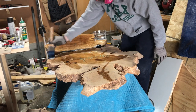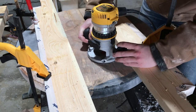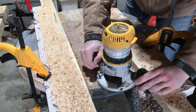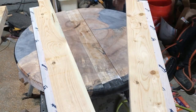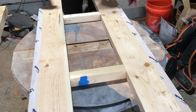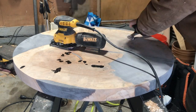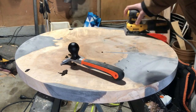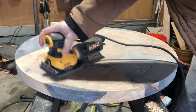I treated both pieces with Bora-Care while I had them out, following the instructions carefully. A couple weeks later, with the slab fully soaked in Bora-Care, I'm feeling confident it's ready for the next stage. I'm inlaying the legs just a quarter inch, using wood pieces as guides for the router, with little spacers to make sure they're in the correct locations. Then I'm heating up those little epoxy spots and scraping them off with a handy scraper, and getting those last little spots filled with epoxy so this thing is just about ready for final sanding.